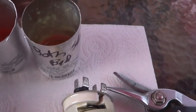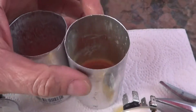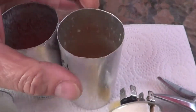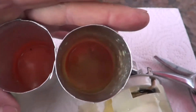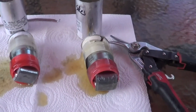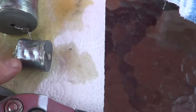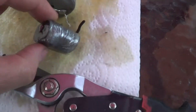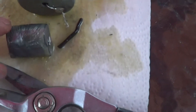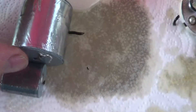Look inside the cans. Looking inside the cans you see a little bit of kind of waxy substance, and the oil looks a little more waxy on the bad one. It's pulled apart further. Now these are the good ones. Notice on the bad ones, both of them are showing arcing inside the layers. It bulged out right there, and this one's bulging out right here versus no bulging on the new one.